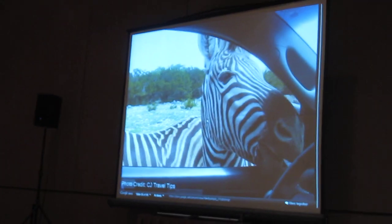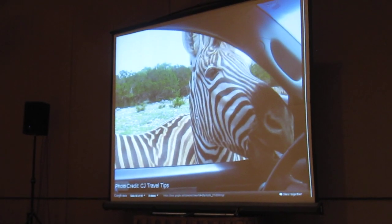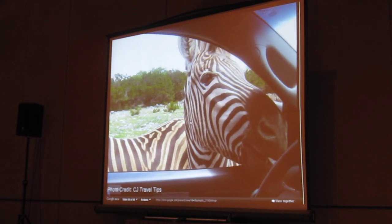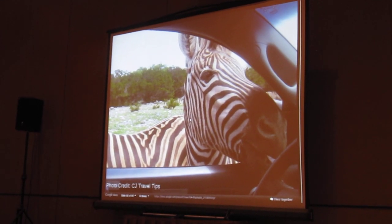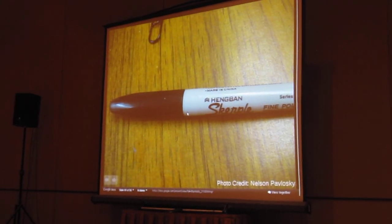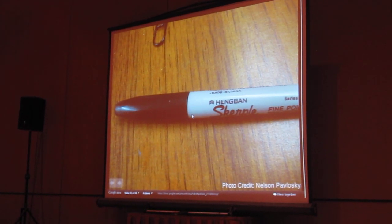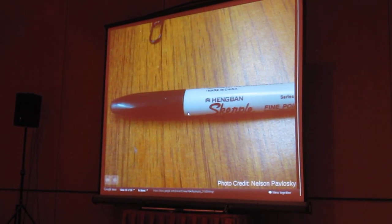Optical encoders are essentially black and white stripes, and you have a little sensor that reads: I see white now, I see black now, I see white now. You have these arranged around your spoke, and as the wheel turns, it'll change from black to white to black to white. People find they don't want to make these. If you're broke, use a Sharpie and a CD. We had one competition where they wouldn't permit us to use anything that wasn't in the kit of parts — they gave us some reminder CDs, and we found a useful application.